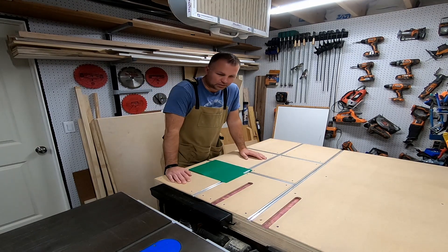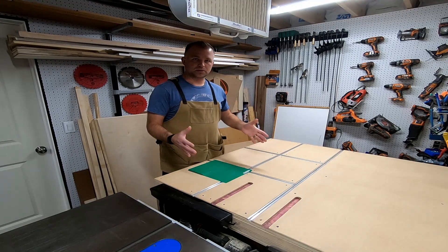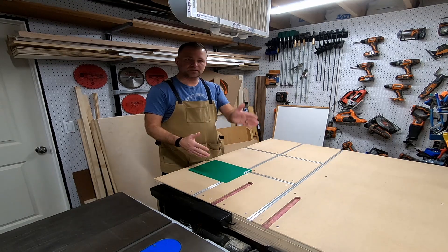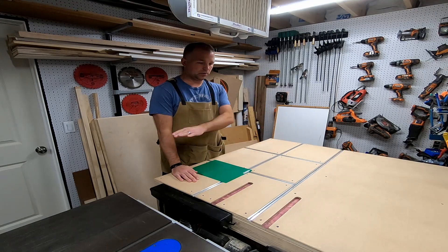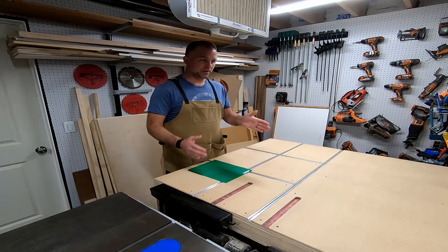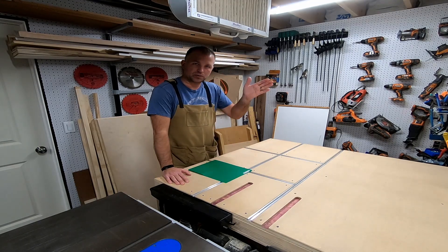I've figured out we're going to do four foot tall on the sides because I think that'll work out good. For the width — studs are every 16 inches, so I want to put it in between three studs. I'll take the middle stud out, so that's 32 inches on center from stud to stud, adding cross pieces at the top and bottom. Studs are an inch and a half thick, so we minus off an inch and a half total — now we're at 30 and a half inches for the opening if we cut the drywall to the stud.